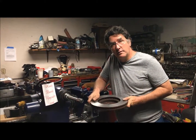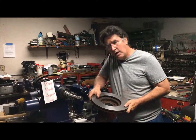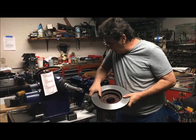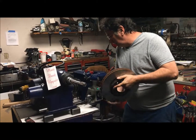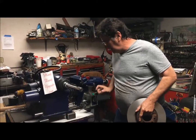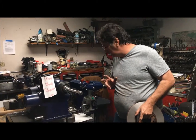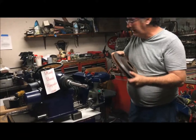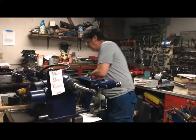Hi guys, I wanted to talk to you about this upgrade for the Amco brake lathes. I noticed when I did the upgrade on this, I had to make the guide bar slide with the crossfeed carriage. It improved the cutting dramatically. The rotors just come off of there beautiful, like regularly the sexiest looking rotors ever.